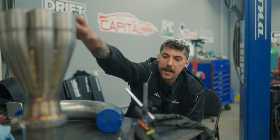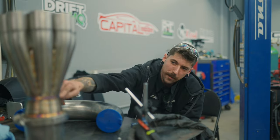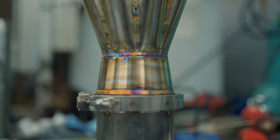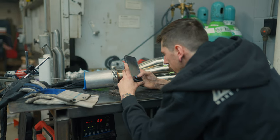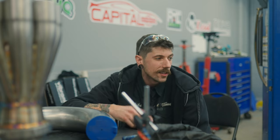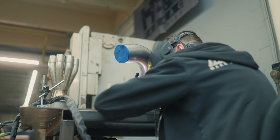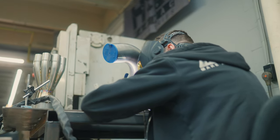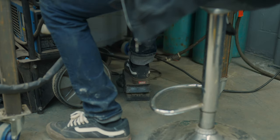We got this big fancy 8-to-1 collector. We have our little power expansion chamber put on it that's going to step from 3.5 to 4 inch, and then 4 inch straight into this big old U-pipe here, which is going to run us beside the frame and then adapt to titanium after that. And most of the day's just been planning and prepping, and then come back and start attacking. And yeah, other than that, stoked on it.